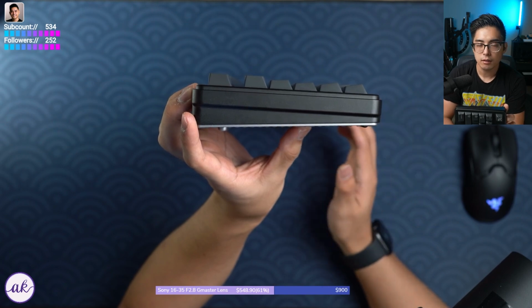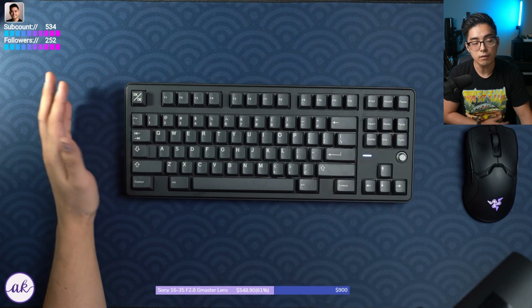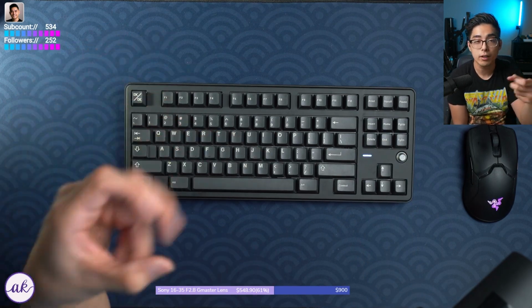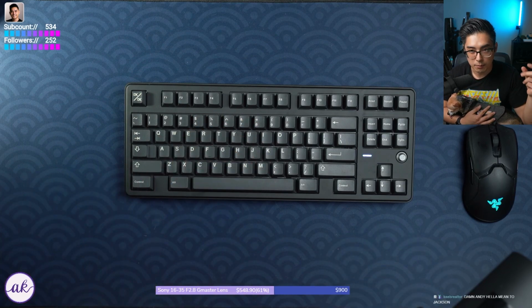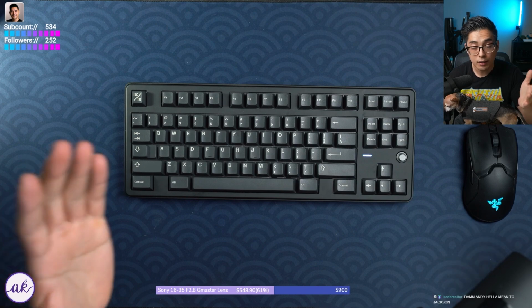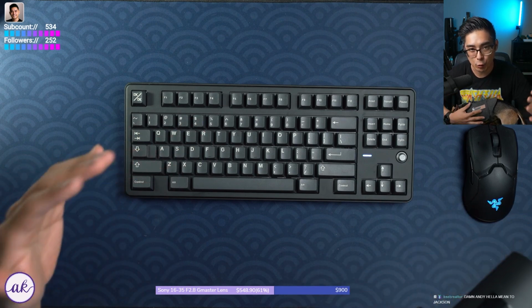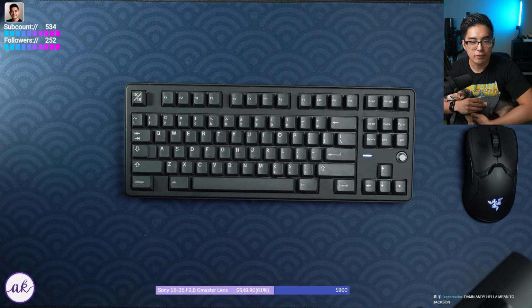So yeah, the silicone dampener. I built this without the silicone dampener with Cherry MX Black's vents, and it sounded okay. It's an aluminum plate. It's a very flexible plate, very much like the Matrix, where it's an aluminum plate, but it's very flexible because of the material they use and the cutouts. I really like the feel of it, but I was bottoming out. So without the silicone dampener, you will bottom out the board. It wasn't shorting, but you definitely bottom it out.